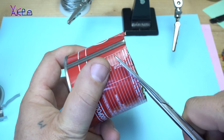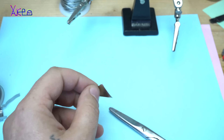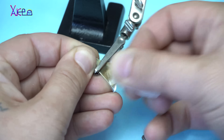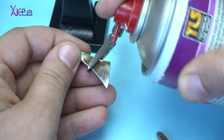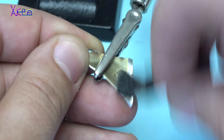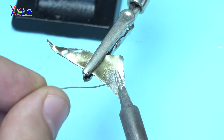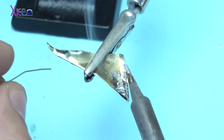Let's say that you want to solder on a metal piece that is not copper. With sandpaper you need to clean the spot, then add some cleaning spray, and add some flux. Increase the temperature of your soldering iron, touch it and put some tin — look, perfection.